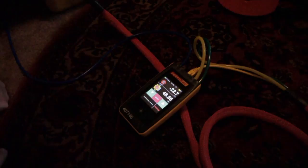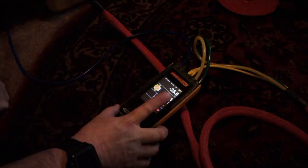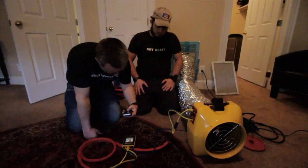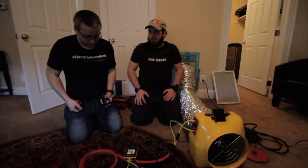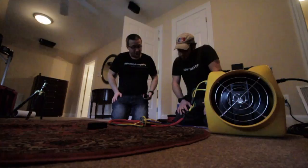Just for fun, I'm going to drop the small ring in. There's just not a lot of square footage that it's doing. So the codes are oftentimes square footage based, and this is what, 500, something like that? It needs a ton of cooling. And it's got a ton and a half, which means it needs a ton and a half of ductwork, and it doesn't really have that. Well, it's not hideous leakage for a system. Let's see what the other ones are.